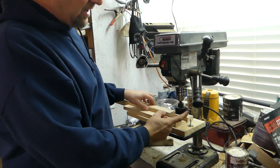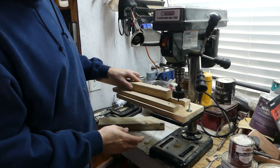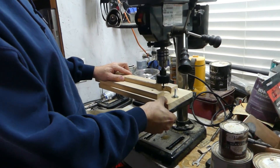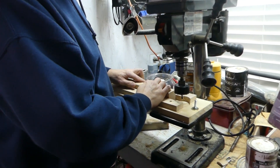I'll show you how I cut those using a hole saw and how I speed up the process of building the uprights. The first part uses a hole saw bit on my drill press. Here's the 2x2 wood — I've built a little jig that holds it securely and bolts to the drill press. I'm just going to cut out a little arch to make the groove.